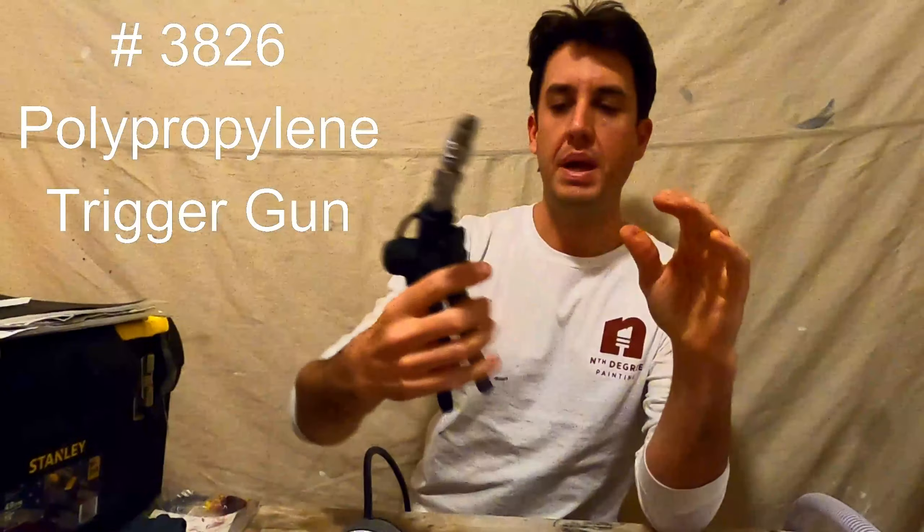So all I do when I plug this in is thread it into a bucket of chemicals. When we're doing a house wash, we have all this connected up here and then several buckets prepped. One person is just the bucket person maintaining levels, yelling to the applicator who's half a house away when there's going to be a switch — when we want to go to water maybe, because there's always some water here if we just want to do a quick rinse on some windows. In rural Vermont where the well doesn't pump four gallons per minute, we have actually used this as the rinse as well as the chemical applicator — it takes some soft bristle agitating and a little more rinsing and time, but it works.